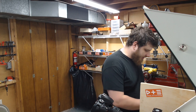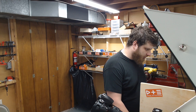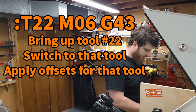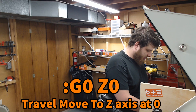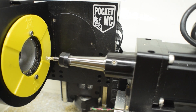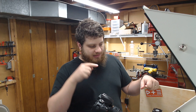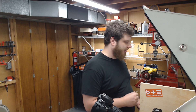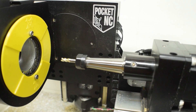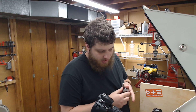There's Y zero. Now we can go to Z zero. The tool may be too short and the machine may not know what tool is in here, so I'm gonna give it T22 and G43. Now it knows it's on the right tool. G0 Z0. The zero point on these five-axis machines is an imaginary point somewhere above the B table and in the center of rotation on the A axis. My stick-out needs to be 0.803, so I'll do G0 0.803 — and there we go. That's where my stock needs to be.